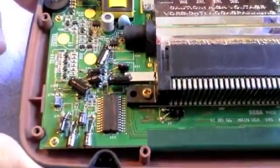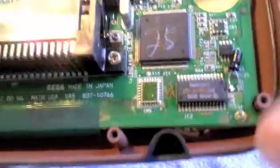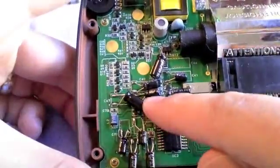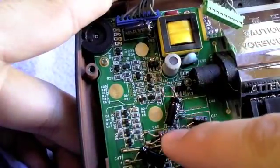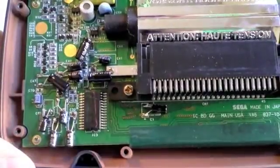This is what it looks like when the motherboard is all done — not my neatest job. One thing I forgot to mention: all of the capacitors are marked with a plus sign for the positive lead. I actually put that first one on backwards so I had to take it off and fix it. Once you get them on there, you can fold them down and make them as flat as possible. It gets a little crowded in places, and it's important to leave these gold pads free of anything because that's where the case actually holds together. Anyway, that's the motherboard — up next is the soundboard.